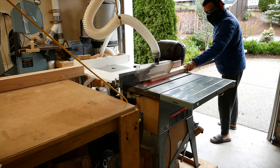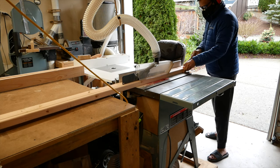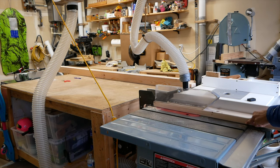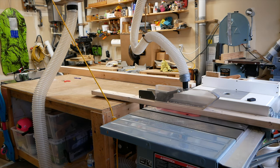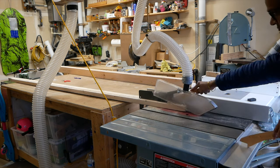After surfacing our boards, we also ran them through the table saw to clean up the edges. At the end of this though, we basically ended up with 2x3s. So if you're watching this video after COVID is hopefully over and the wood quality is back up to its usual standard, you could probably get away with just buying 2x3s and skipping everything until now.